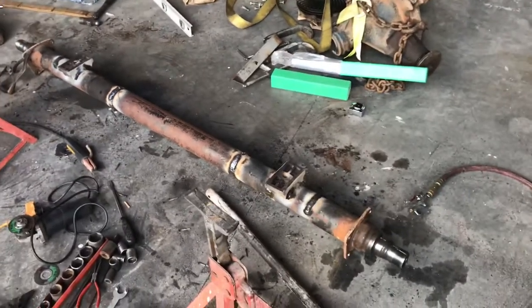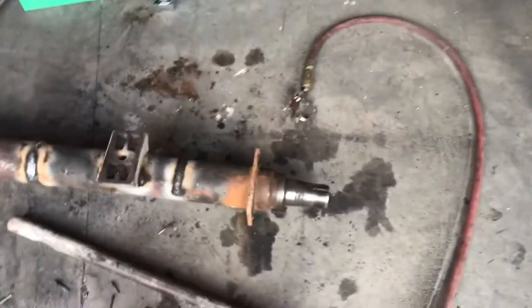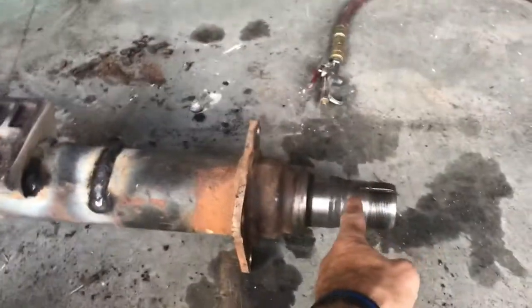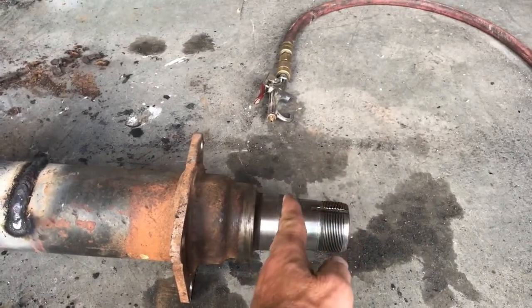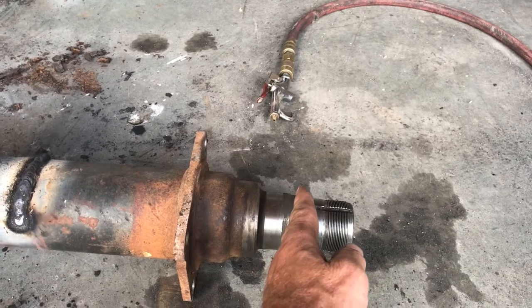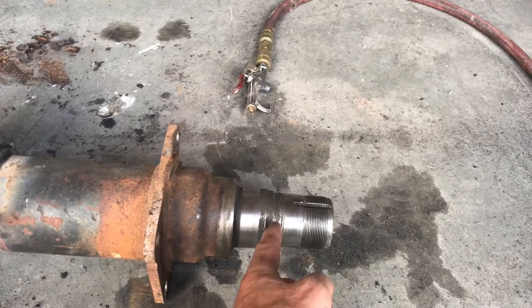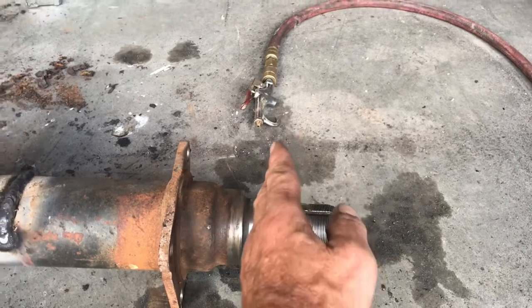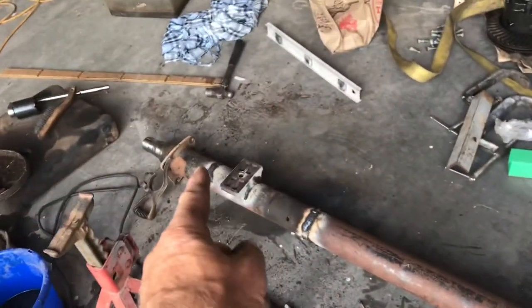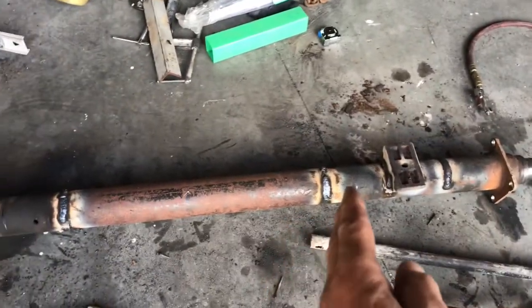We're all welded up — let me show you what we got so far. All I had to do is calculate from the center of the flange of the wheel. I figured out where the wheel needed to be on my trailer, so I calculated the distance between the two bearing surfaces. Right here is where the flange is, and over there is where the other wheel flange is, so you calculate that distance and just weld in a piece of pipe.